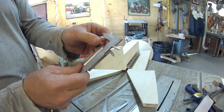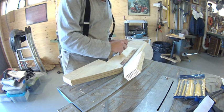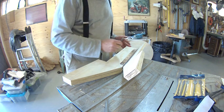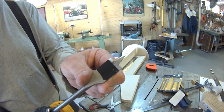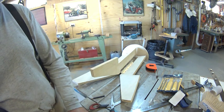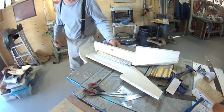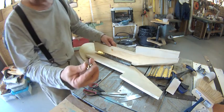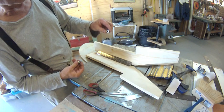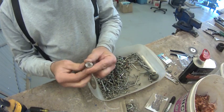I'll use these spade bits - I've got a 19mm here, that should do it. Mark a spot, probably right midway and near the edge. These little magnets are 8mm thick, so I'm going to set that depth. My fancy depth-setting gauge here is 4mm. And that will leave me, in this piece, around 10mm separation between the magnets. I'll put a screw straight through it - a nut on this side will make a taper on the nut. And this side will just use a tapered head screw. That will hold it in there.